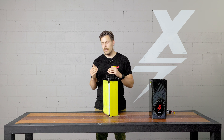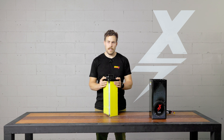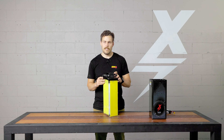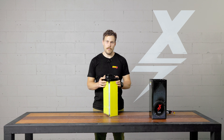So we've gone to potting the batteries with a compound that's a semi-flexible solid material used in potting all sorts of electronics. The batteries are filled all the way up to the top of the BMS, and that locks everything in place. We've never had any issues since then with balance wires or anything coming off a battery.